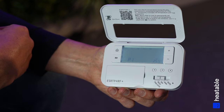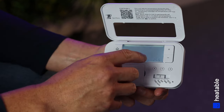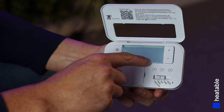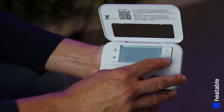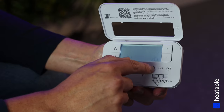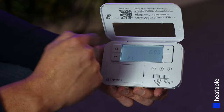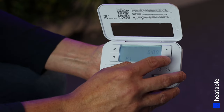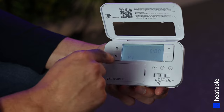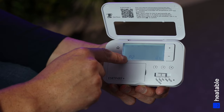You'll get different set points, times, and temperatures to choose on the programmer. Right now, Program 1 is set to 22.5 degrees to come on at 6:50 in the morning. If you want it slightly earlier — say 6 a.m. — click Next, then set the temperature you want, for example 21 degrees, and click Next again.